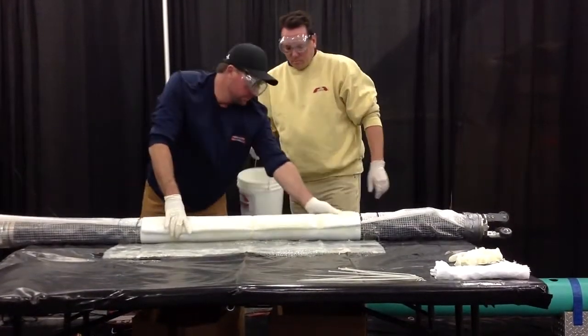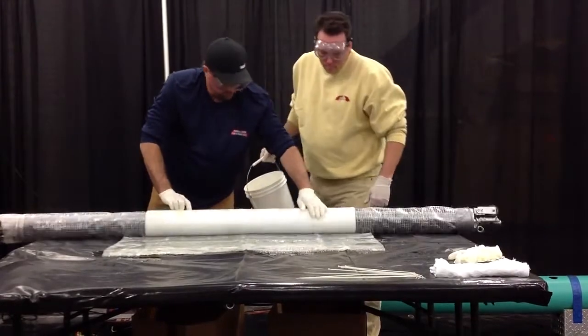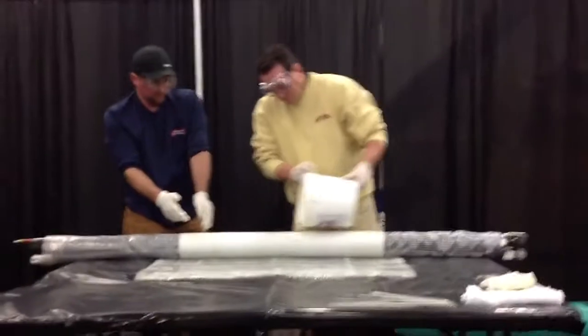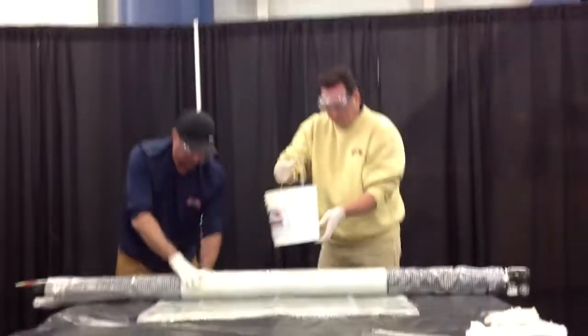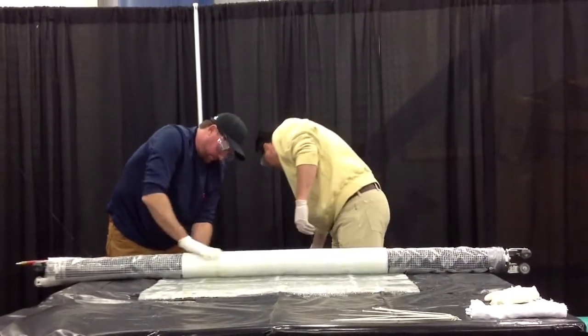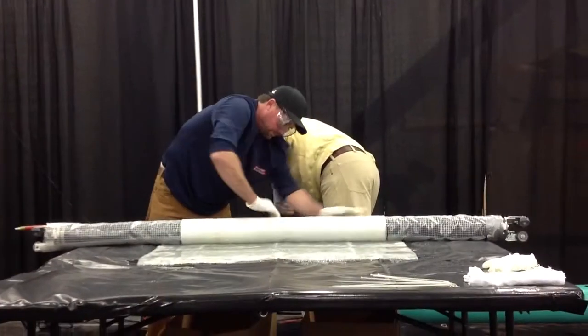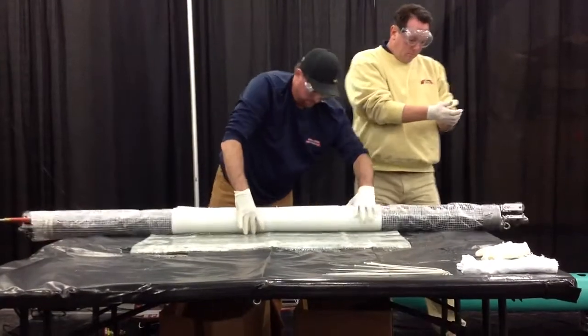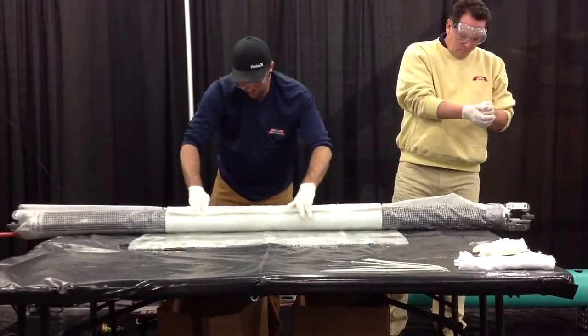You'll notice a difference in coloration between the 100% solids epoxy and the sample I'm showing you here, which is our typical sodium silicate-based resin. The sodium silicate gives you a faster cure time, especially in extreme environments. They're currently curing them up in Maine in about an hour and a half, ambiently, with no external heat source.